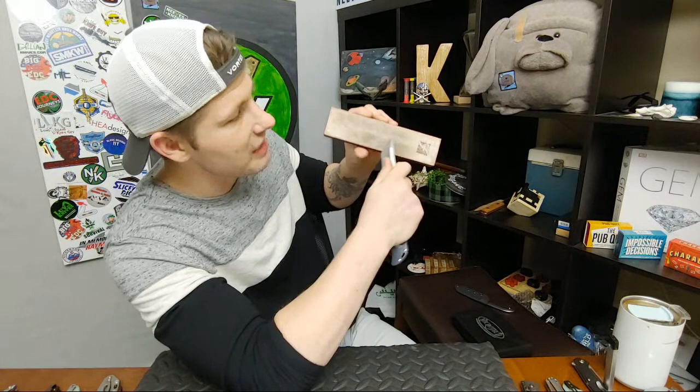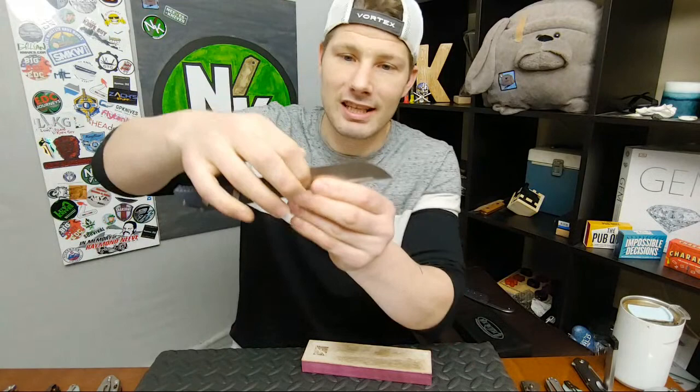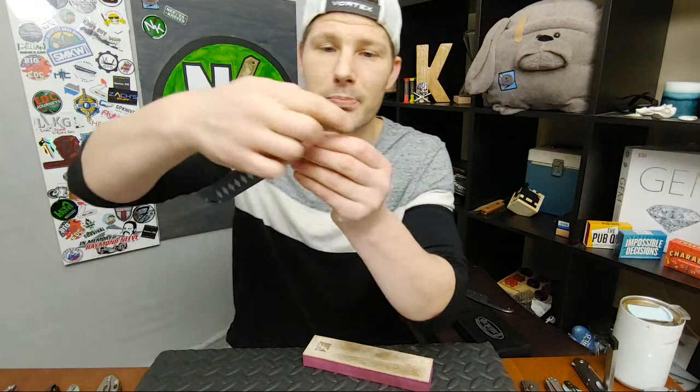You have to sharpen it like you're sharpening two knives. This is one knife. This is your second knife. And then, in the end, you marry the edges together to make this little point, which is going to happen anyways. Through the sharpening, you're going to have the tip there. You're basically just making the knife look like the edge just goes all the way around, or like the grip pattern kind of matches up. Marrying your edge is basically for, because sometimes this part will start pushing over farther down the knife. So like I said, watch my marrying your edges video. It'll explain it.